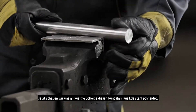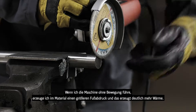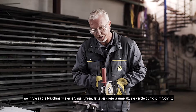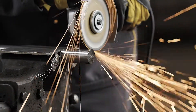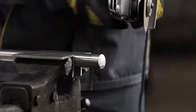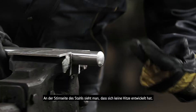Now we'll have a look at a piece of solid bar — again, stainless steel, solid bar. You'll see the method of cut is slightly different, a lot more movement. If you keep it stationary going down, you create a big footprint into the material and generate a lot of heat. If you use it like a saw, it dissipates that heat and it won't bind in the core. So the 1.6 wheels are very versatile, cutting from very thin material right through to much heavier material without any problem, generating no heat.